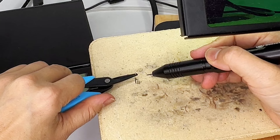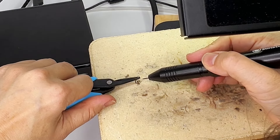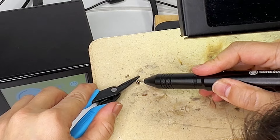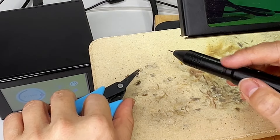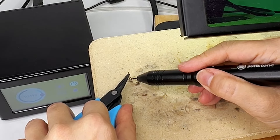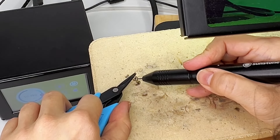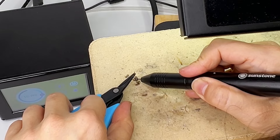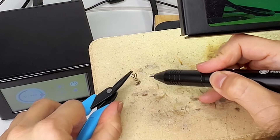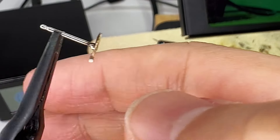Do not worry that it breaks off just yet. As you go, try to straighten out and press down instead of taking it off — that way it helps with the metal flow. You can correct along the way. That has melted.